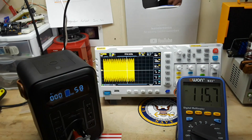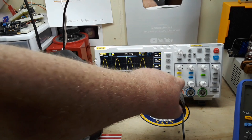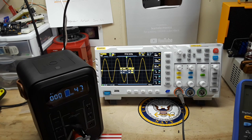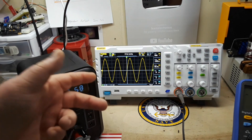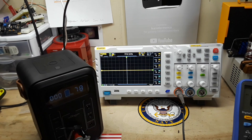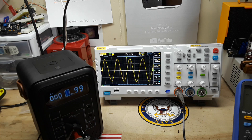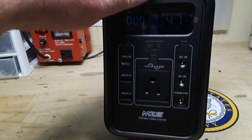It'll bring up an auto set. Yeah, it's not too bad. Channel one, 10x — yes we are. 60 hertz, peak to peak 346 volts. It's not the cleanest sine wave I've ever seen, but compared to old school inverters this is absolutely fine. So very pleased with that. It does output a very nice sine wave and the voltage is right in line for what we use here in the US.